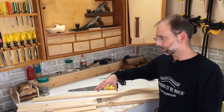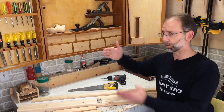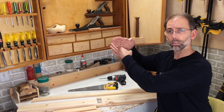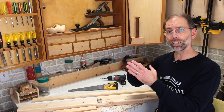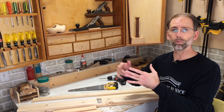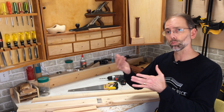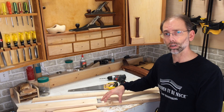I need to create two bases. One is going to be at the top of the stairs — I'm going to build an X for the base to make it stable for the upright. At the bottom of the stairs I'm going to make a T to make efficient use of the material. I only need support in three directions because the step at the bottom will help the other side.